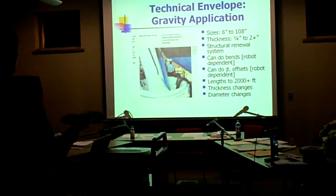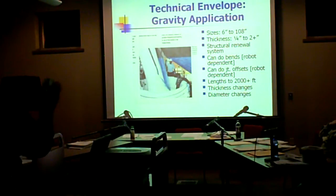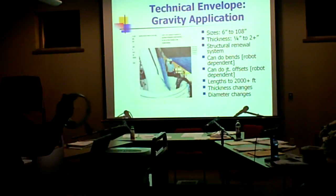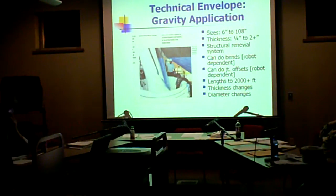An 8-inch line, 300 feet takes an hour — rule of thumb. But we saw today a tube that was 350 feet, 18-inch diameter, 7.5 mil. Our engineers calculated that if we steam cure it, it was 2 hours, and if we water cure it, it was 2.5 hours. So they follow that chart and know what they're doing. It's relatively standardized.